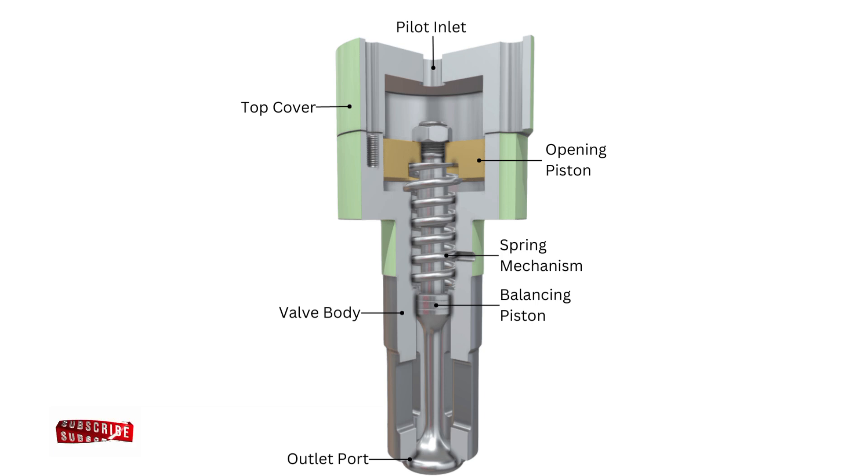What are the safety interlocks? The starting air system has several interlocks to prevent accidents: air will only be admitted to one cylinder at a time; the starting system is disabled if the engine is already running; and it's also disabled if the turning gear is engaged.